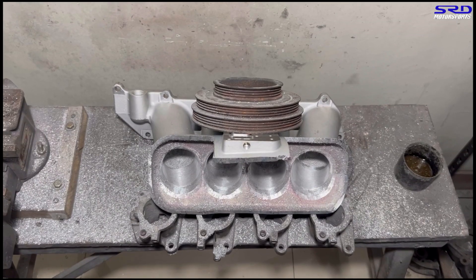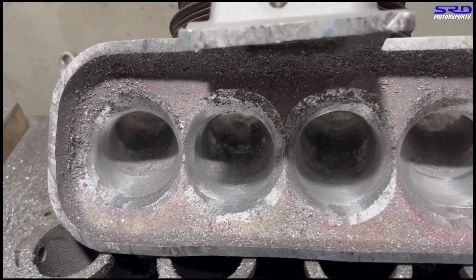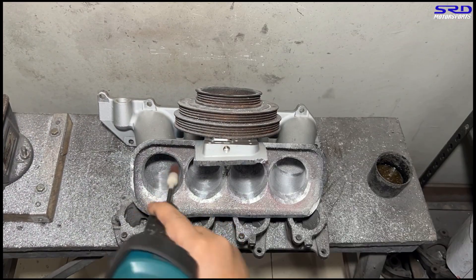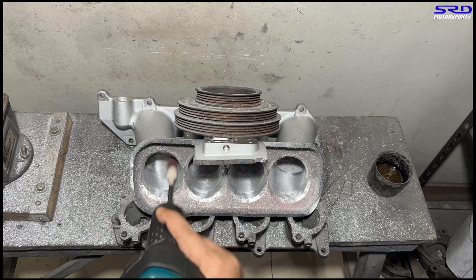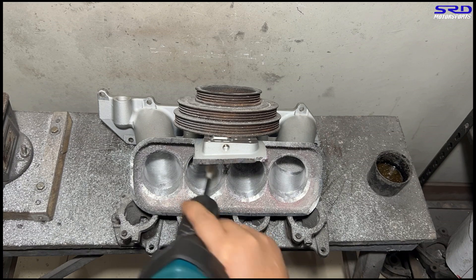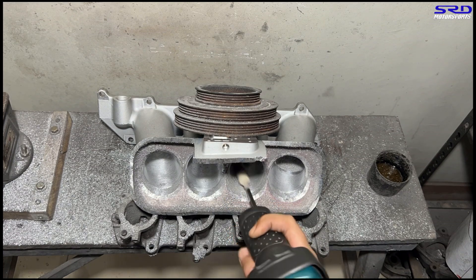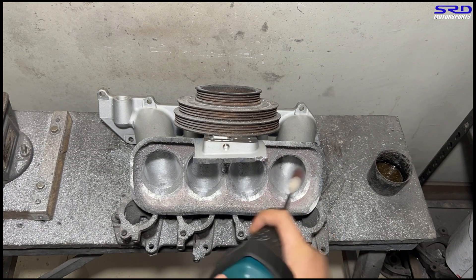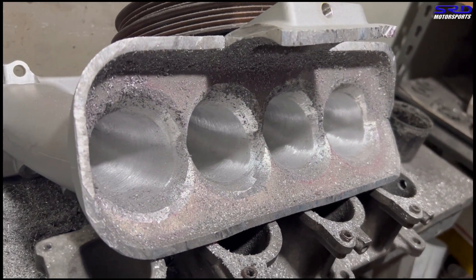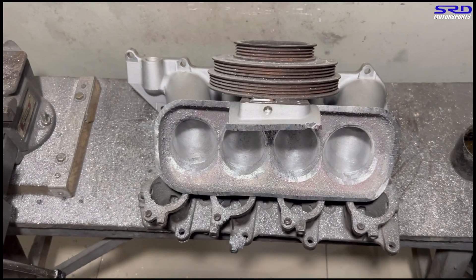Looking closer, it's starting to look really good. Now we go in further — we're going to reach around 70 to 80 percent of the runner length so we're almost done. We're going deeper and the whole runner length is starting to look really good. Now we just need a few more passes to get it all smoothly consistent. Now here we are with 120 grit — we're going to get smoother and smoother.